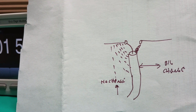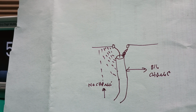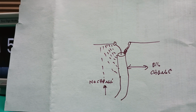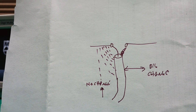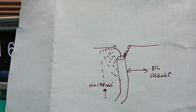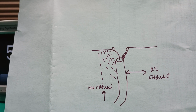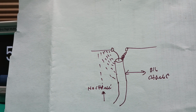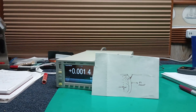And you can test that by holding the transmission line still at the feed point and start bending the line towards the center conductor side of the center conductor arm of the dipole. As you go further and further up and bending it, you'll start to find a point where it'll change SWR. And that will show the extent of the fields. And that'll change with power levels, because power levels change the potential, the voltage levels, and that changes the field coupling. When I tested the 20 meter dipole at very low powers, I was expecting coupling between the feed point and a nearby tree. I didn't get it until the powers raised considerably. Then it jumped off with field lines over towards a tree. So there's the answer to the mystery that's been bugging me day and night for months.